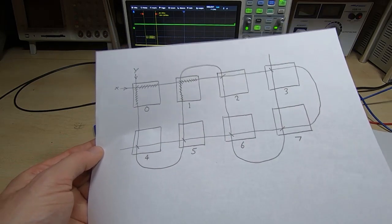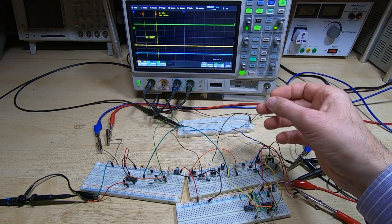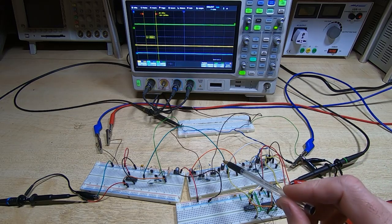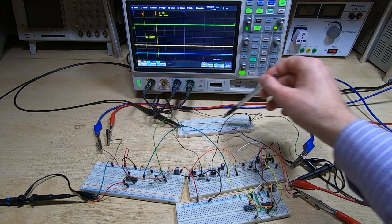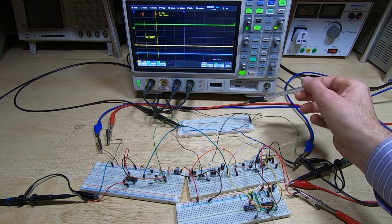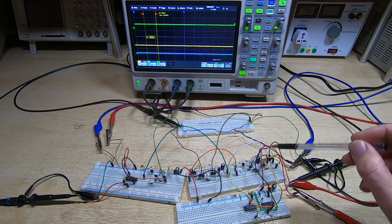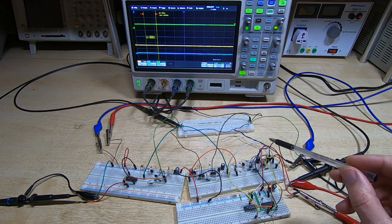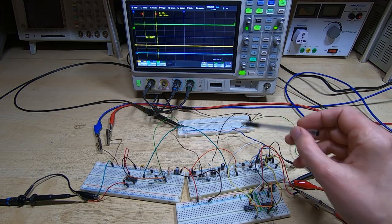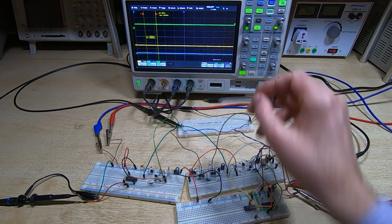So that's why we use the inhibit wires. What we'll do now is power this up, switch on the signal generator, and apply 500-nanosecond pulses to the sequence generator. The way this is set up, we're going to read the single core at the end here — the other cores are still on these wires but we're only selecting the one on the right. The other cores are there just to load up the system as it would be in the final array. We'll read the core by passing current through it in one direction, then after a half-microsecond delay we effectively write a one back to the core; otherwise we'd only see a single pulse and then it would stop responding.